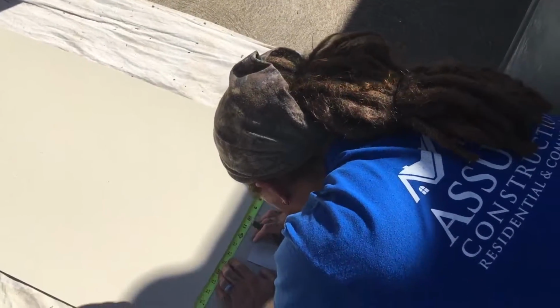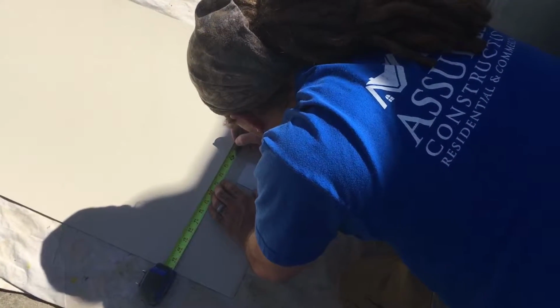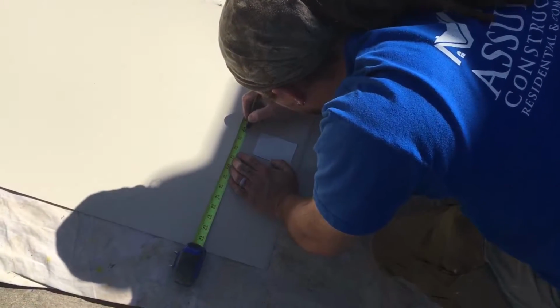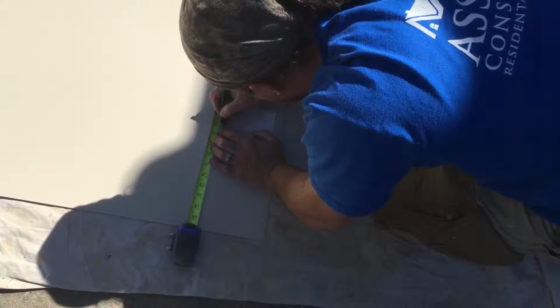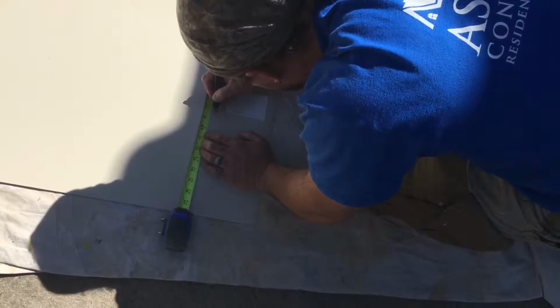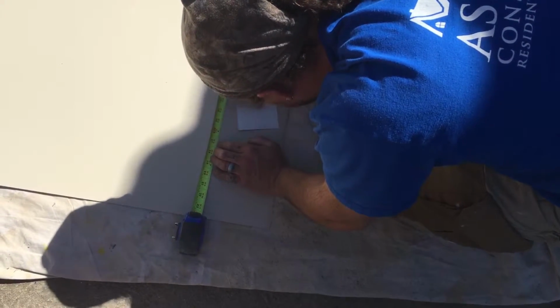So now I'm on R. So then I have 2 3/4. I'm gonna go 1/4, 2/4, 3/4. So then I go 14 3/8. Bend. 2 5/8. 17, right?